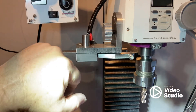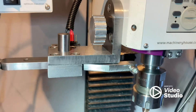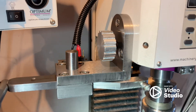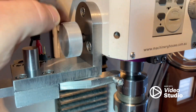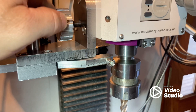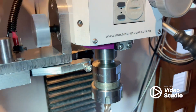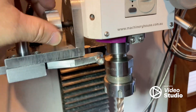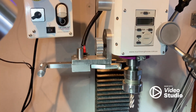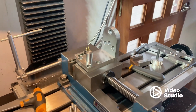Just a little tap and bang it turns off. So what I'll do is disassemble this just so you can have a better look to see how I actually made this. That there is just the original quill lock, and what I did was just make the thread a little bit longer and drilled a hole in the mounting plate so it can reach the quill. So that's got nothing to do with the spindle lock. I'll start pulling it apart and show you how I made this.